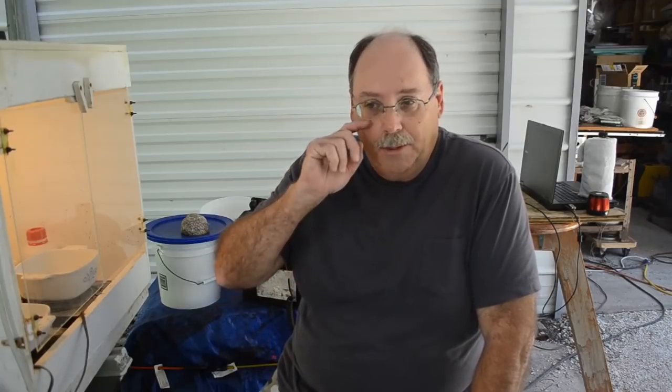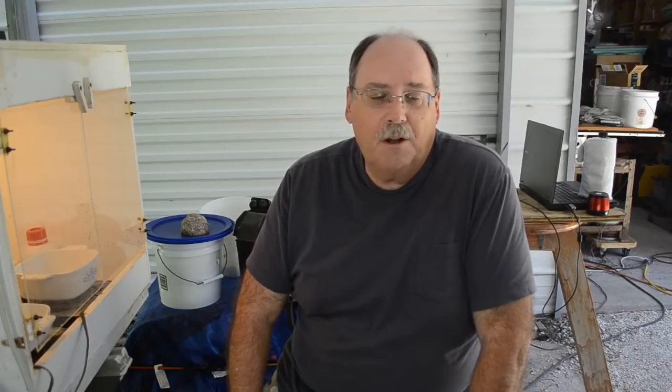So that's, I think, what happened in this case. I was running a lot of stuff through it, good, probably 35 pounds of stuff maybe, but it's low grade and it probably stripped that gold off real quick, and then it started attacking the copper underneath and the tin underneath, and loaded itself down with those base metals, so by the time it was done it wouldn't strip any more gold off of it. A lot, probably about half of its stripping power went towards stripping off base metals rather than just gold.